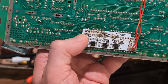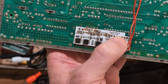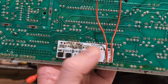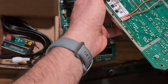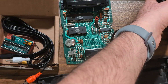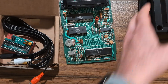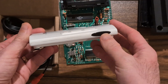The clean comp is a circuit board where you solder onto the TIA's leg pins, then solder the video out and audio out, and you're good to go. But if you suck at soldering like I do, this is not a viable option either. The only other option if you don't even want to open your console is to use an old VCR.